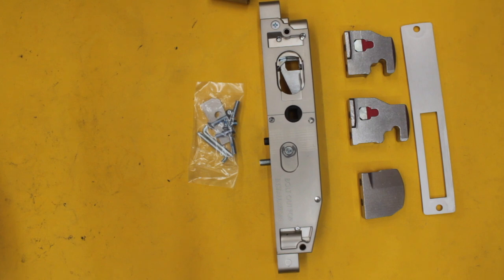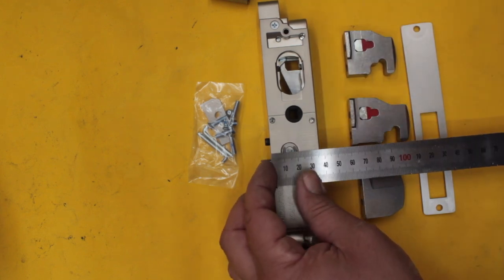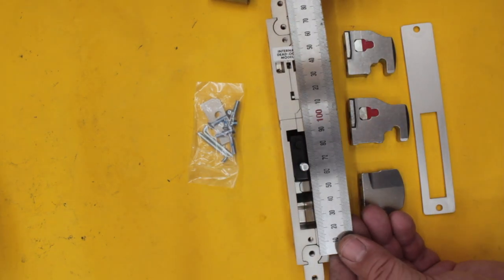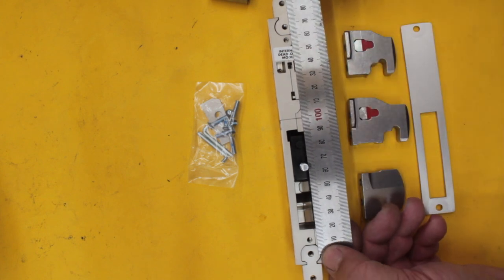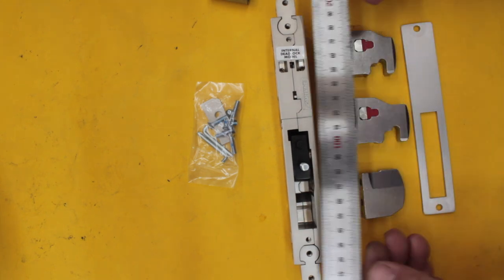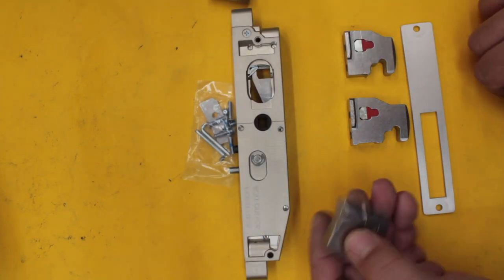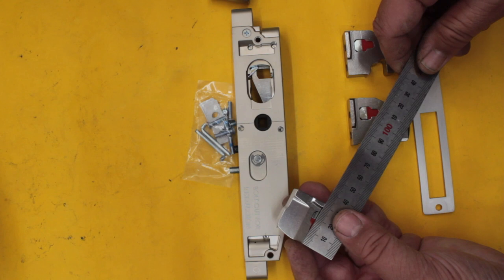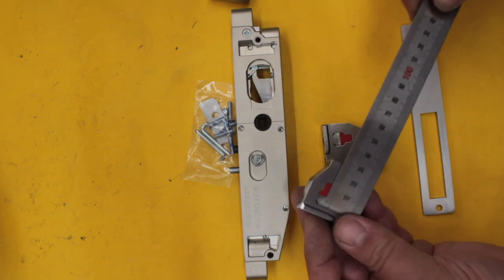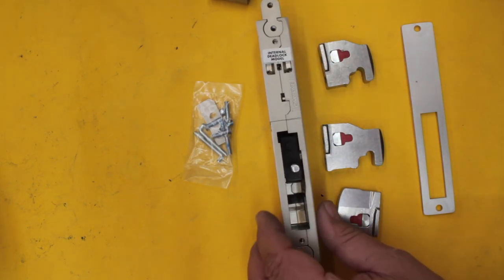It's pretty much a standard flip bolt — there's nothing really out of the ordinary. The lock body measures 182mm in length. The depth on this one is about 37mm, and the width is about 23mm. For the face plate, measuring from the centre of the bottom hole to the centre of the top hole is 168mm. From the bottom hole to the top hole, which is what you would mount into the aluminium, you're looking at about 204mm. The protrusion on the long bolt is approximately 25-26mm, about 43mm overall, and for the medium one about 33mm. Now I'm measuring from this lump here because once they're actually in the lock they'll probably be recessed back a few millimetres.